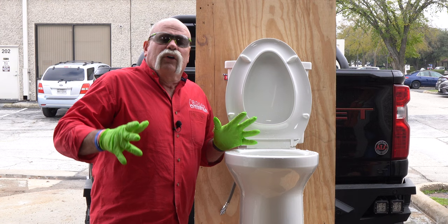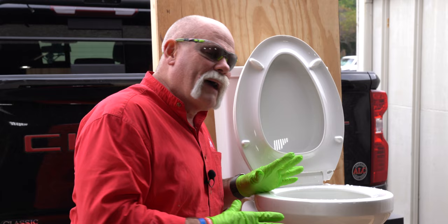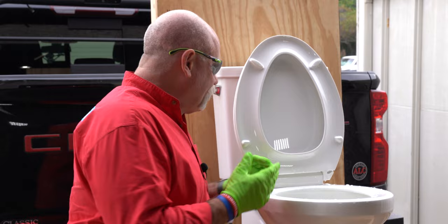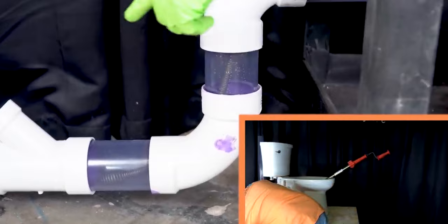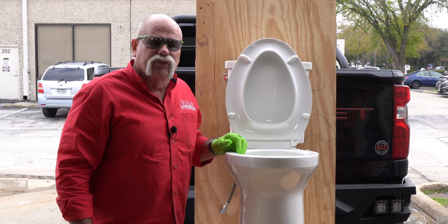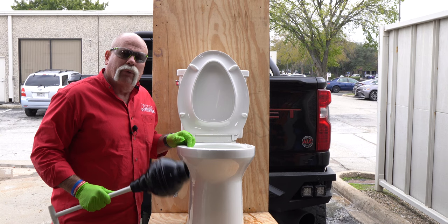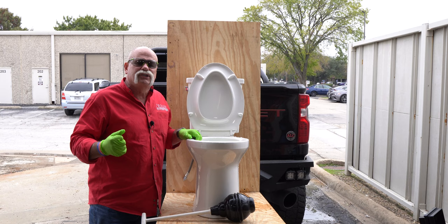So if you're a plumber or you're thinking about getting into plumbing, this is something you need to know how to do — get in there every time and be able to take care of your customer. What happens if you plunge it and closet auger it and nothing happens? Well, you may have a blockage further down the line. Remember, we've got a vent pipe behind it, and the drain pipe goes out. If you run that extra long closet auger down there and it doesn't get it, and you plunge it and nothing happens, you may have a break or a clog further down the line. At that point, you're either going to get up on the roof, go into a wall clean-out, or do some other things. As a plumber, apprentice, or tradesman, you need to have the right plunger on your truck, a closet auger, and the things you need to do your job right each and every time. If you want to learn how to use a closet auger, I'll put a link in there — go check it out, and I'll see you in the next video.